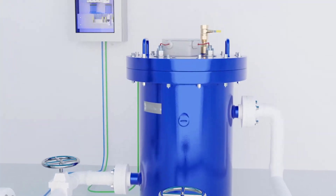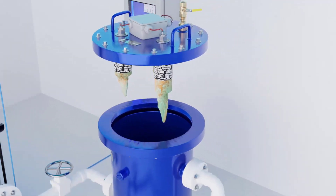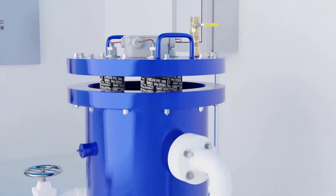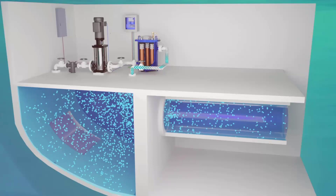All maintenance and replacement can be undertaken by the crew whilst the vessel is in service. The anodes will continue to protect the sea chest and the seawater piping systems by distributing ions from the anodes throughout the system, protecting them from marine life and corrosion.